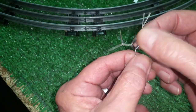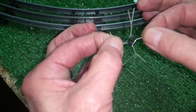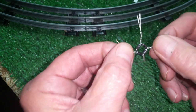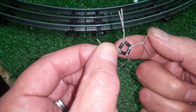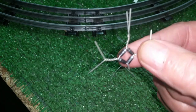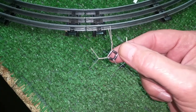You will attach AC to these two wires. This will be DC negative, and this will be DC positive. Really, really simple. You can see how small this thing is — it's smaller than a postage stamp. And remember, this is 50 volts at 1 amp, so you're not going to pull 1 amp through one of those CAN motors.